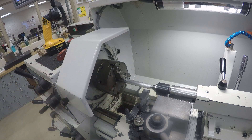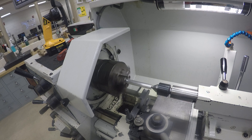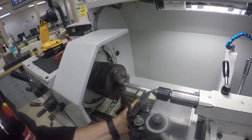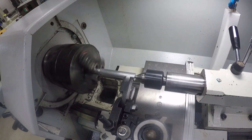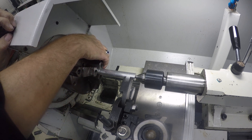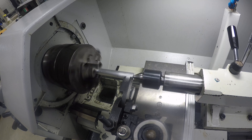We want to start with the rollers half on and half off. First we close the tool and turn the spindle on, then engage the feed. I can come in close just to look. Once I'm past the edge of my part, I stop and reverse direction so I can see that I'm half on, half off the wheel.